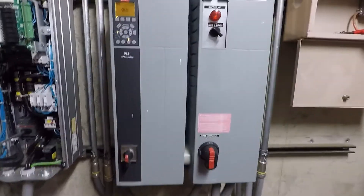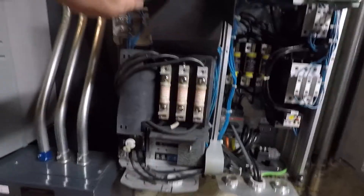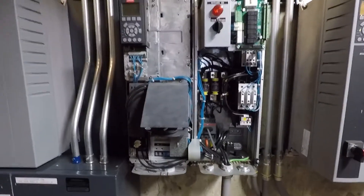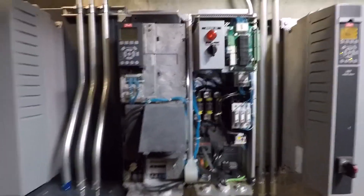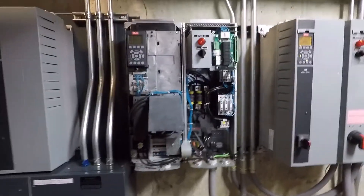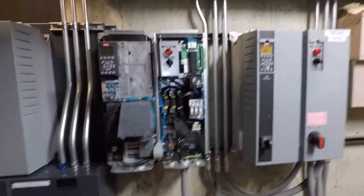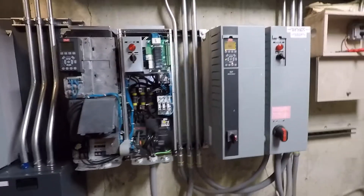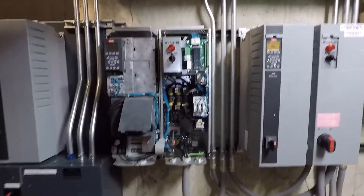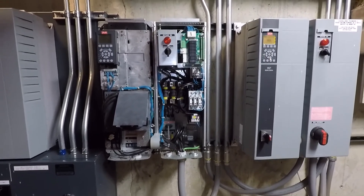The whole off-the-shelf idea is debatable. This factory unit — you'd think being factory-made means it's off the shelf, but when you add the disconnect switch and the fuses required for the bypass configuration, that makes the drive non-standard and increases the lead time. So in my opinion, the debate about reducing lead time by cutting options — I don't think you're going to realize the benefit you think you will by shaving off those options.